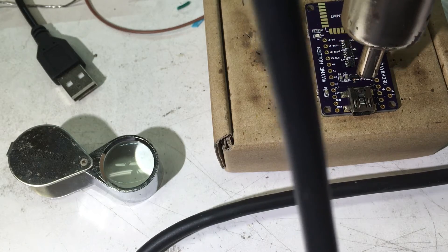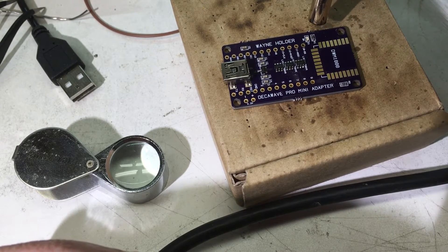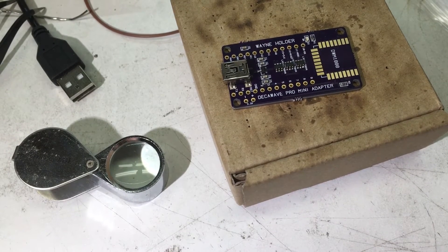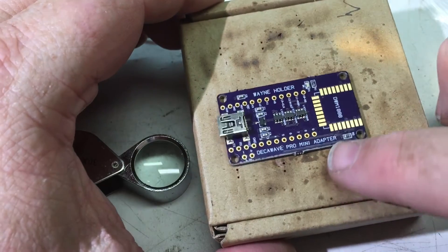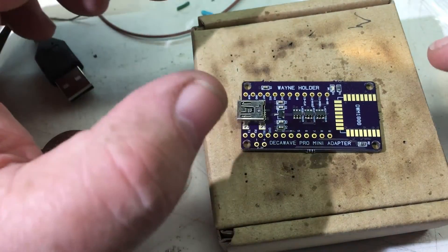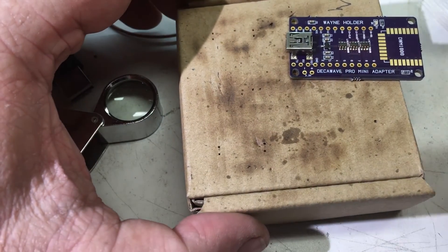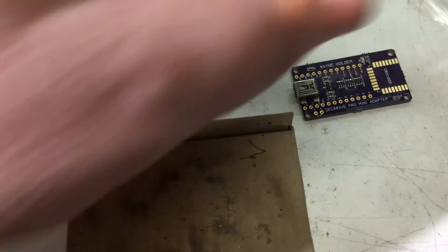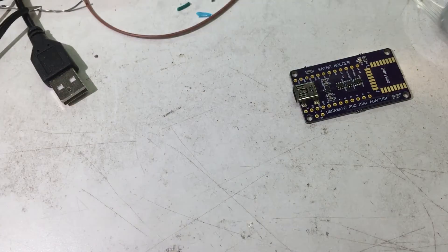That one flowed really quickly. Then finally we've got to heat this whole thing, and now I just turn it off and let it cool down. I actually like to solder on top of a little cardboard box — for some reason cardboard is relatively unaffected by the heat and doesn't soak a lot of heat away from the circuit board, letting it heat up correctly. I've tried ceramic tiles and other things, but a leftover cardboard box works well. The board is now really hot, so I can set it down onto the surface to let some of the heat work away. Now is a good time to get out the eye loupe and go over everything.